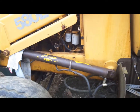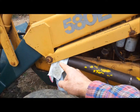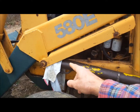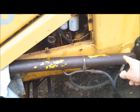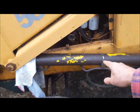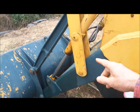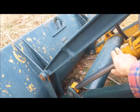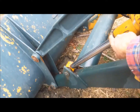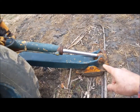As I mentioned in a previous video, cylinders should not be mounted so that the top part of the rod is at the top like this. They should always be angled downward — the rod should have been placed on the opposite side. The reason for that is so it doesn't get water infiltration. This rag here is to prevent water infiltration. As you notice, these cylinders that move the bucket are tilted downward — that's the way they should be, so water just runs down and doesn't go past the seal.